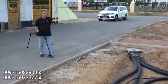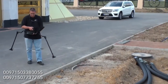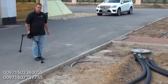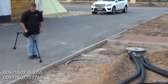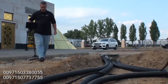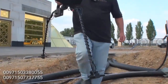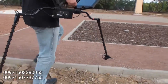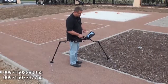I'm going to do a short scan of this area. We have a freshly buried water tank here. To start the scan, I'm going to push the multi-function button one time — the light will blink. I hold the unit comfortably in my hand, push the button. It is blinking. I look at my screen and I have the signal coming in. I will hold this as steady as possible over the object. When I am done with my scan, I push the button and the scan will stop.